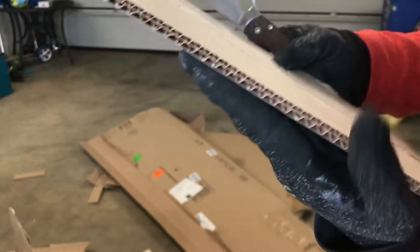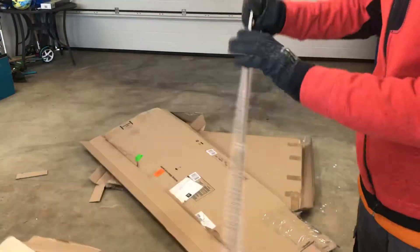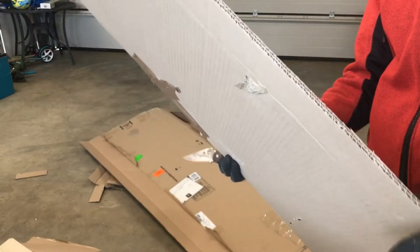There was no way for the PM2 to cut through this kind of cardboard this way with the original full flat grind and the original dominant edge bevel at around 15 to 20 degrees — somewhere there, not exactly sure, but it's a little bit more.